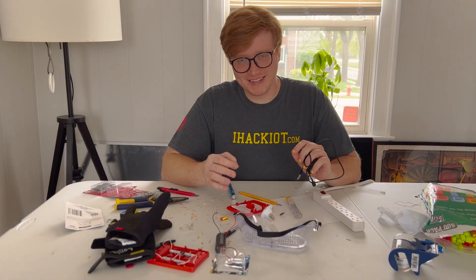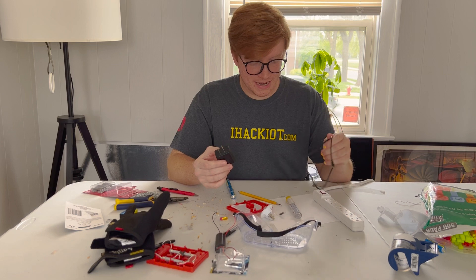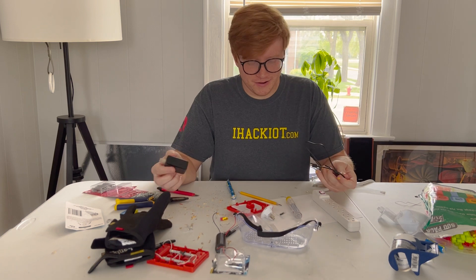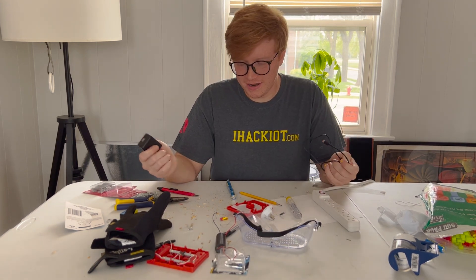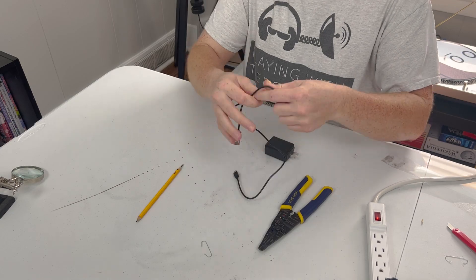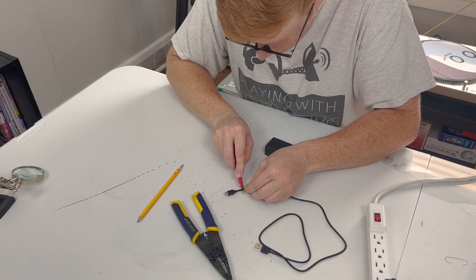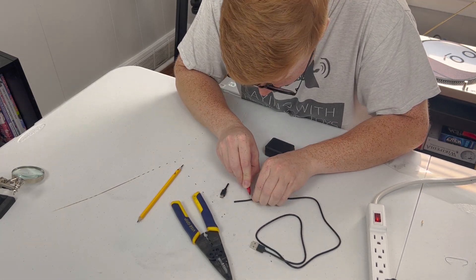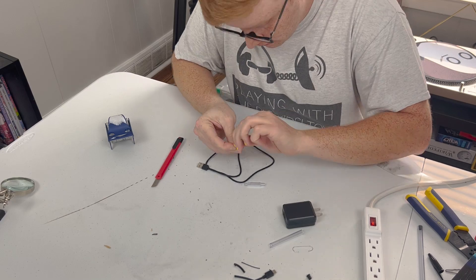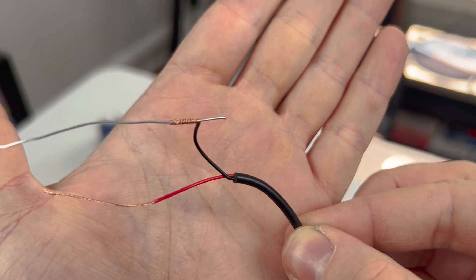It is multiple days later and I'm back and I've decided to cheat. I was originally not trying to use any micro USB cables and whatnot just because my dollar store didn't have any that were actually a dollar — these are the kind of things you'd find there for five bucks. But at this point I'm kind of done with playing with AC power. So for this one, we're doing something a bit different. The USB brick I've got here is five volts, two amps of DC power, and we're basically just going to be shorting that across one of the dollar store Christmas hooks. I first chopped the end off an old micro USB cable and stripped back the wiring to expose the positive and negative wires. Then it was as simple as looping them around either end of the Christmas ornament hook. You can see we've got our negative lead on and we're just going to put the positive down here.